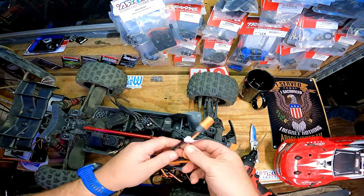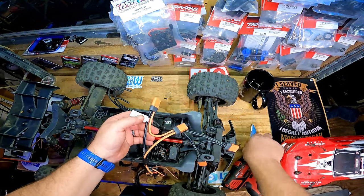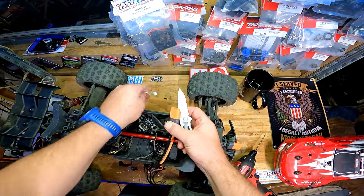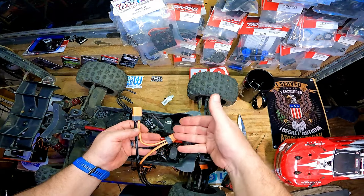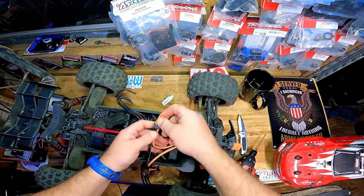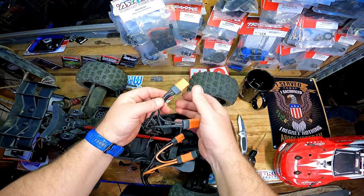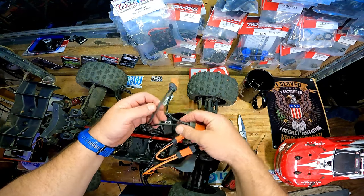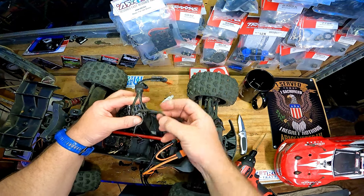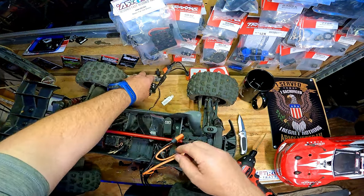Some people like the black but I don't see the point. Here's the one thing - when you're using the jumper lead you want to go for the black, so you put your jumper here. Put your battery on the black cable, and then put this here so your telemetry works. You want the jumper on the orange and then your battery here. When this whole thing is black like this, you kind of lose that - you could see the little negative lines but especially the way it was clamped it's kind of crazy to think this whole thing has to be replaced. It's a shame because it's still a good ESC.